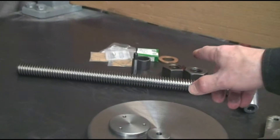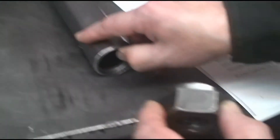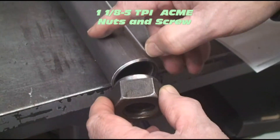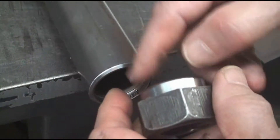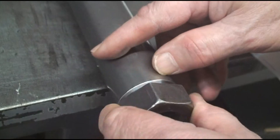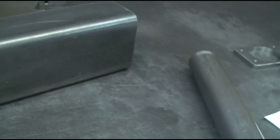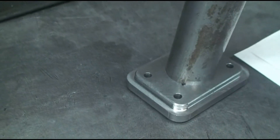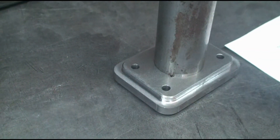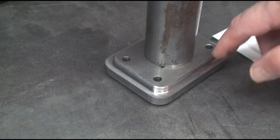The first part of this is to weld together these pieces. This is the first nut, which was modified — it's turned a little bit to fit into this tube. It fits in here and sets against that shoulder, sets right up there nice and snug, and then use about a sixteenth of an inch to weld. Now the nut is alloy and the tube is just carbon steel, so you should hook these together with a 308 stainless steel rod. It then sets into this piece, which is the rear piece, and sets in here just like that. You would then weld this — that will all be mild steel, so it can be welded with a common mild steel rod.